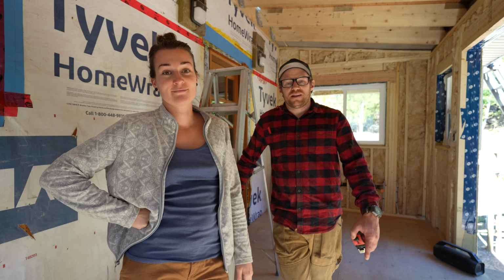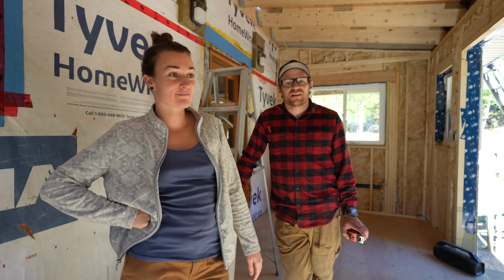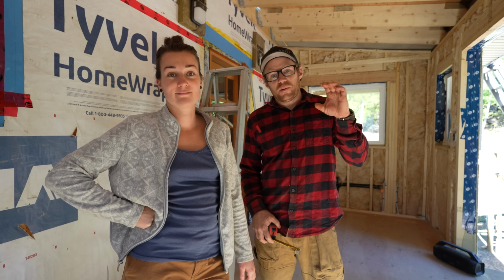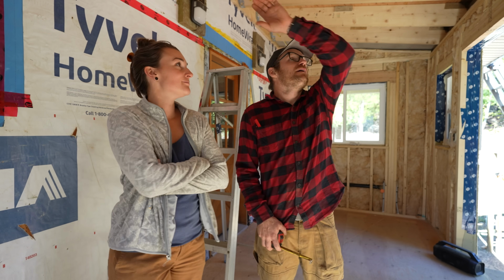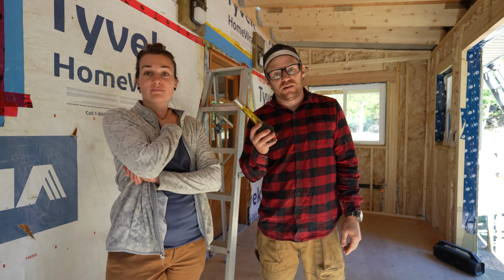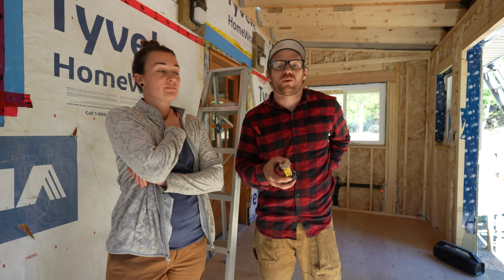And so the way that we're going to be insulating today is pretty unconventional. Yeah, unconventional. So we're going to be putting some repurposed polyiso rigid foam, 3 inches of it, up in the ceiling, like we did in our original house build. Some of you remember that, some of you weren't around for that.